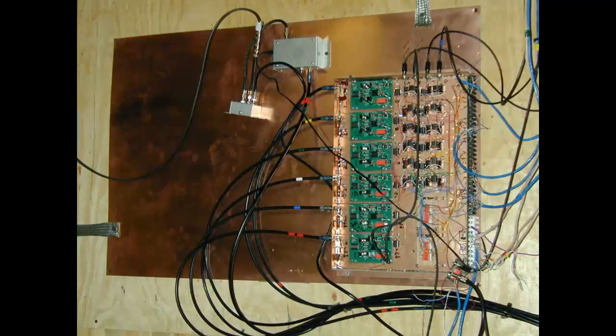In this multiplexer here, I have preamplifiers. These are the only amplifiers in the system, by the way. Even if the cable goes back 1,500 feet, the only amplification is actually up in one of the buildings at the house end of the system. And if you look at this box, all the receiving antennas come in on the left-hand side. And at the top, you see four jacks at the very top. Those jacks go out to different receiver lines. So there's no change at all either, whether you bridge one receiver in or all four of them, all the levels stay the same.